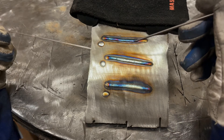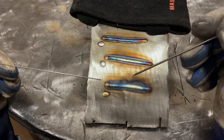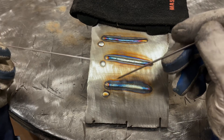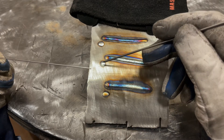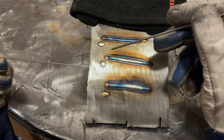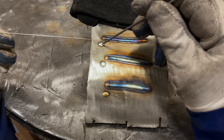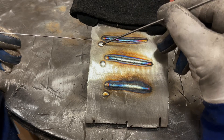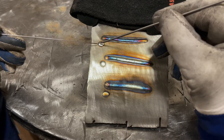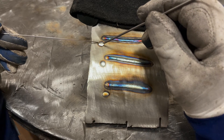Now that I have a new O-ring on and a proper collet, it welds pure silver, like you can see in these spot welds — so we're a lot better. Always pay attention to that. So, is there ever a reason that you don't want to backdrag with TIG? And the answer is yes. When you look at these spots here, these dictate what you're actually seeing with the weld pool. When you have a push angle, this is kind of what your molten pool will look like — the more extreme it is, the more pointed it will be. TIG tungsten's right there, pool's here.